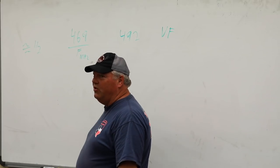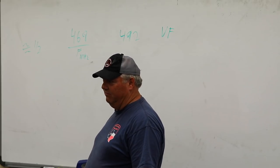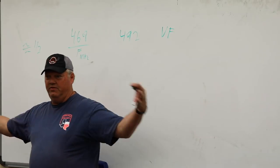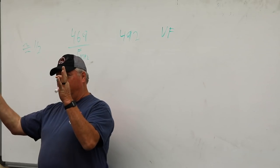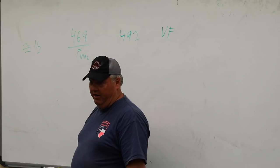Who knows what the number 234 divided by frequency in megahertz gets you? Quarter wave. Exactly. So look at that sheet. What does that sheet show you? It shows you the full half wave, which is 468 divided by frequency in megahertz. And the quarter wave side of it would be half that, 234, right?